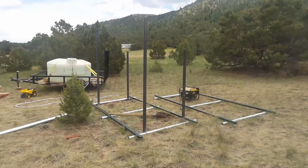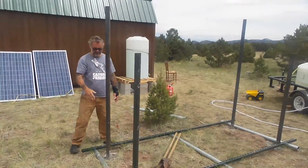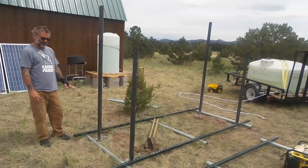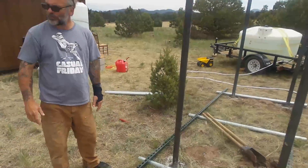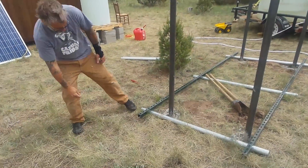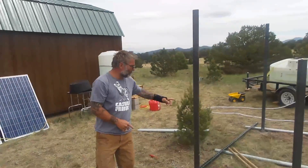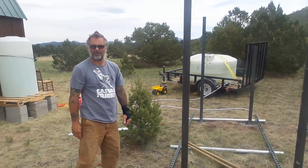I'm working on my racks once again. I've got my posts in the ground - this is a two-inch schedule 40, so I doubt it's going to move much, especially with the framing system I've got going here. I'll run a diagonal cross tie to really tighten it up if I need one. Just looking and measuring, I'm only going to be able to get three panels per frame, so I really need to get eight panels up. I'm going to see if I can extend these poles by sliding a channel over a channel, maybe grinding some tabs off, and if I can get two bolting points I should be good - make an extension and get a fourth panel on there on both sides, dividing that load up.